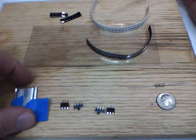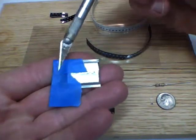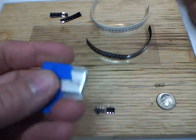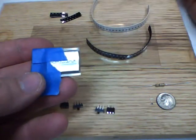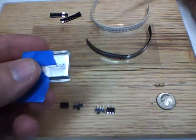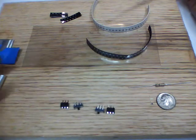I actually prefer to go to a lighter battery. Here's one that's been out of its package for a while. Notice the safety tape on there so it doesn't short out against items on the workbench. This one happens to be an 80 milliamp hour. With 80 milliamp for my setup with four LEDs, it'll get you about 45 minutes of flight time.